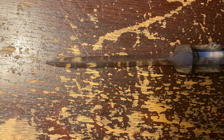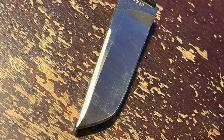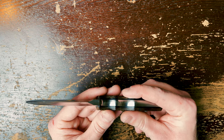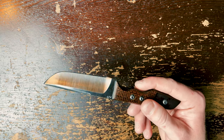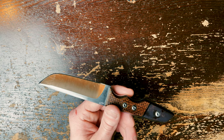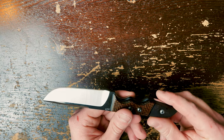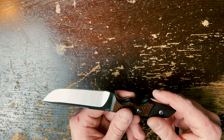The blade is hollow ground, and that removes enough weight to help the knife feel relatively quick and easy to use for such a thick blade without sacrificing robustness. The angle of the edge is fairly shallow overall. It's tough for me to show that to you on video. And this makes the edge difficult to touch up as I go, but it also makes the knife more durable. I love that the edge angle is shallower up front and steeper at the back. This is very useful. Also, more on that later.